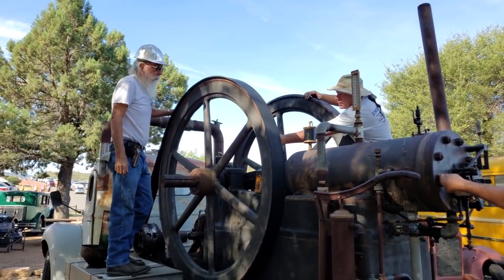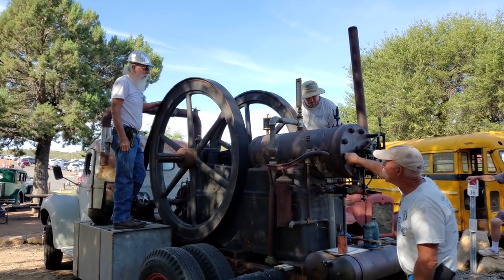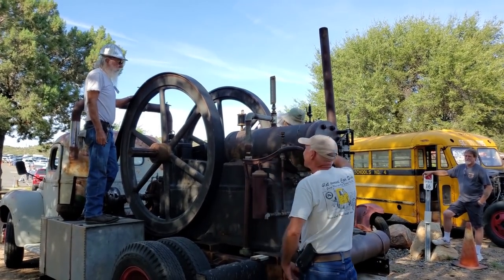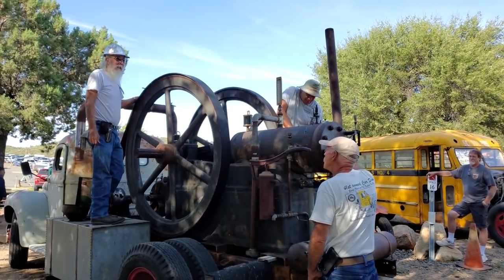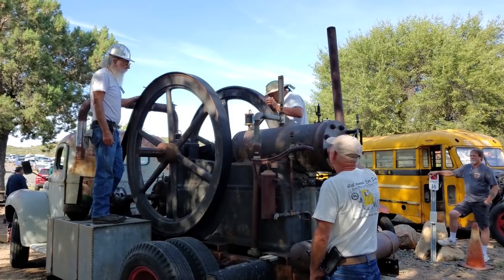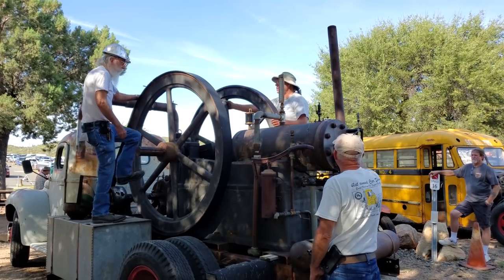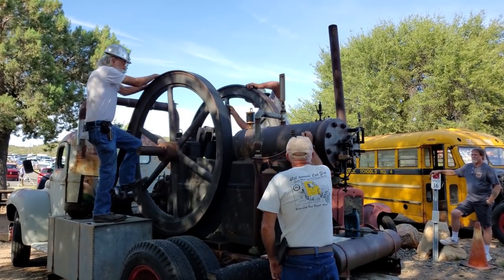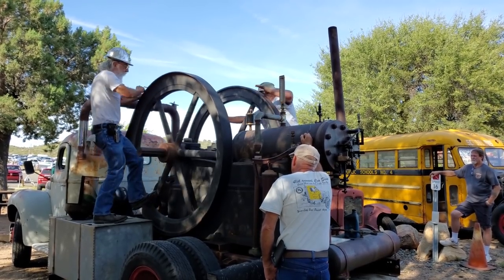I've watched Advance Rumleys start that way too. A lot of the Rumleys, they just walk in the flywheels and spin them over — to me that's kind of scary. There are a lot of places to be oiled, and while Ethan is learning we're taking our time. What type of oil does it take? Just about anything. I don't like synthetics — it tends to drain off too much when it's not running.